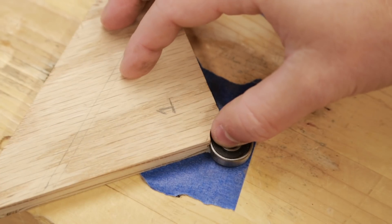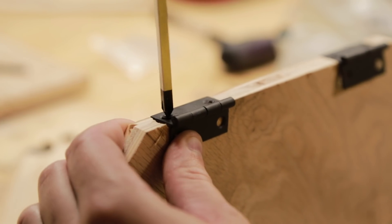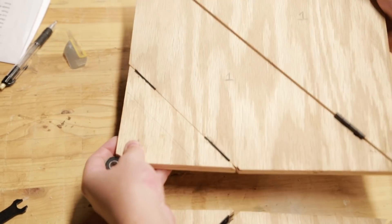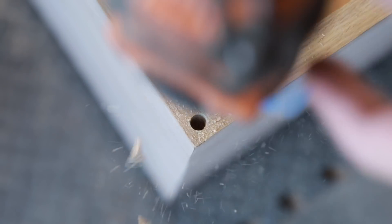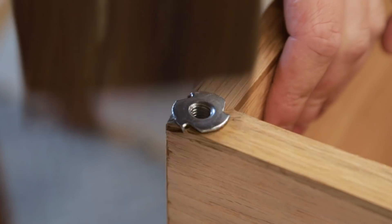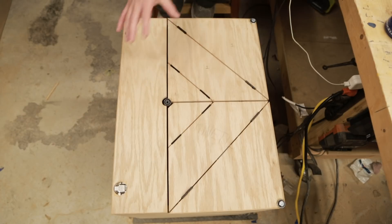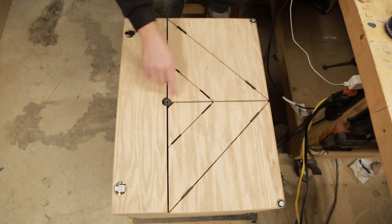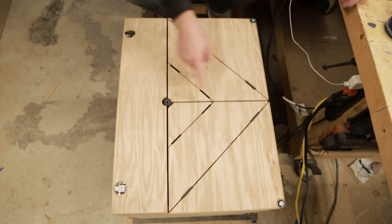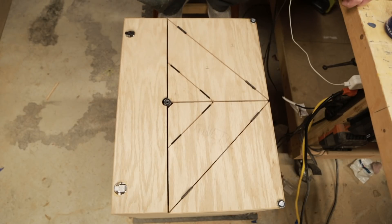That's why I said I would go back and cut a little extra wood for the corner so it had something to hold on to. Now that the pivot points are done, you just have to install the hinges. Two hinges have to be installed inwards while the other two have to be installed outwards so that the trapezoid and small triangle can be lifted outwards. I used T-nuts in the corner so that I can send a bolt through the bearings and secure it to the frame, with CA glue on the nut so they don't come loose over time. I have this tower on its side so I can start putting together this door. I doubled up all the ball bearings — so there are two in each one, six total. These doors only work with perfect squares, so you'd need a two-to-one ratio rectangle, which I thought would look a little weird, so I installed a hidden-hinge door instead.